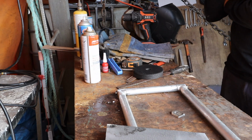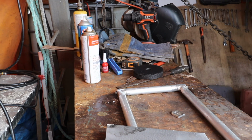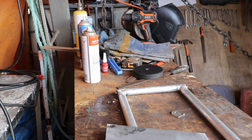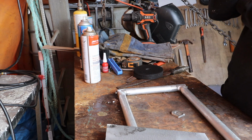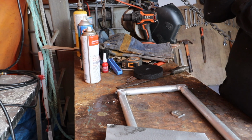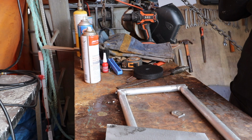Yeah, g'day. I bought a Unimig welder off you guys a few weeks back. And it's welding really crap. We can't actually get the settings to make any difference on the weld at all. There's just no heat coming through it at all, and I'm not sure what's going on. I'm wondering if I can bring it in and set it up and see if we can replicate the problem, and you guys can see if it's something obvious or not.